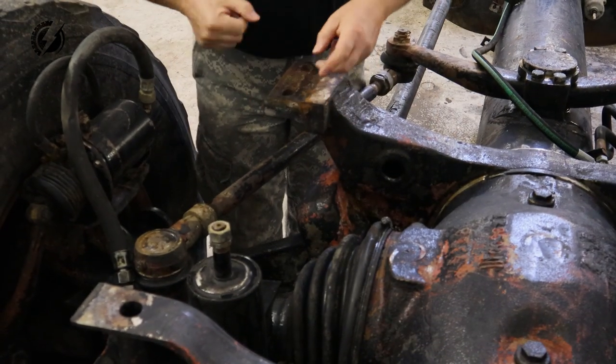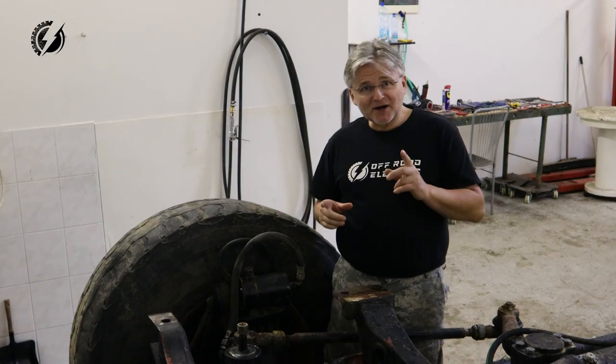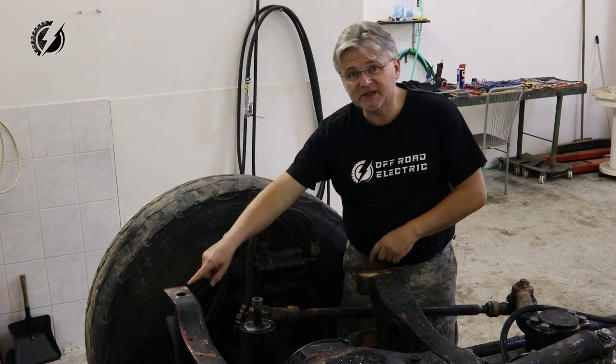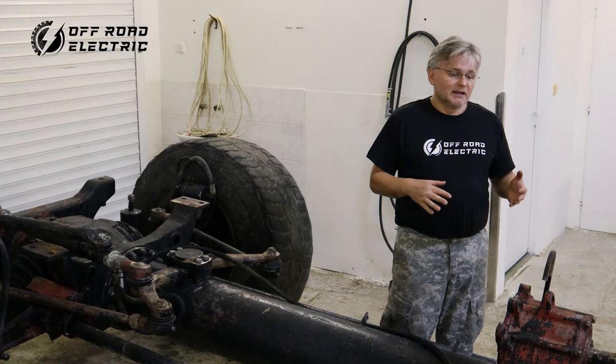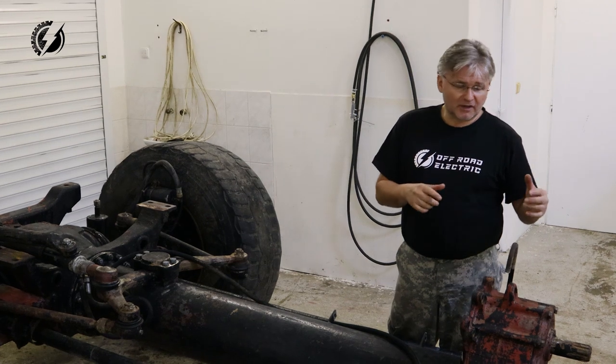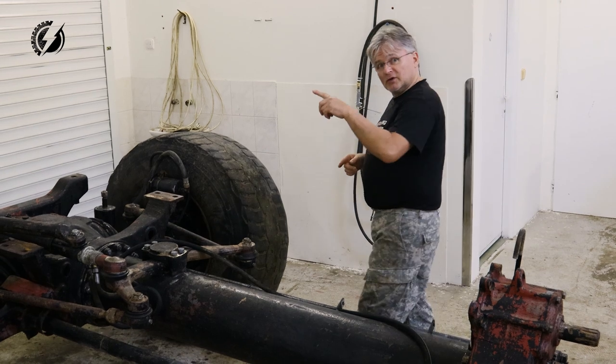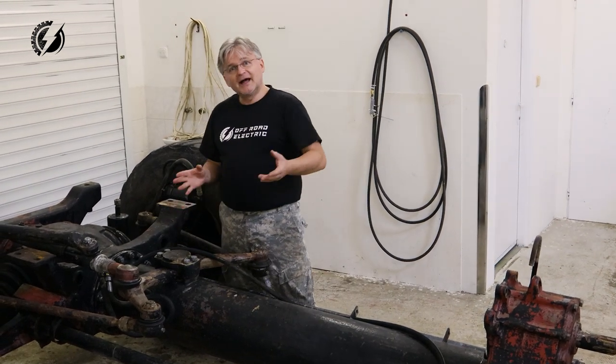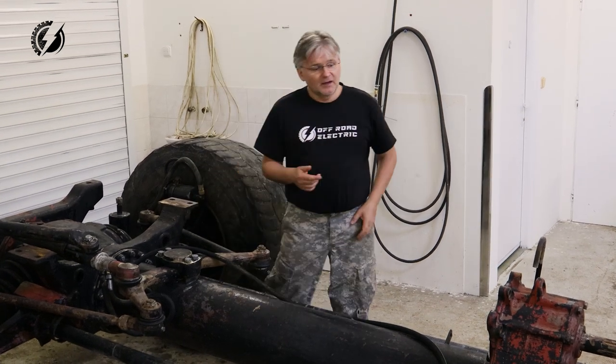Each airbag is up to three tons, but there are others up to four tons. We'll insert it into this area over here on special brackets we are going to make. These airbags will be self-adjustable - it means if I am sideways on a hill, the top one will deflate and the lower one will inflate more, so your vehicle will get more leveled. The airbags with all the brackets will be able to bolt on the half axle and to this crossmember without necessity to weld.